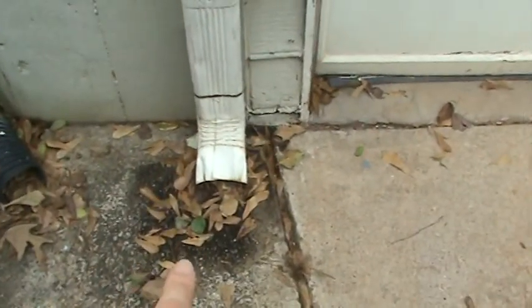So we would start with the chimney or the whole left side. The backside of the house is in pretty decent shape, surprisingly. See this downspout right here? Completely clogged — so all the water's run down this side of the house and just rotted the siding out. The gutters have stuff growing out the back, so these gutters haven't been cleaned in at least a couple of years. The back of the house is mostly the lower six boards; the rest of it, see how nice and tight the bottom edges are? If we came in here and caulked it and hand-painted it, that siding would be all right. If you spray paint it, it's not gonna do much — it'll make it look pretty but it doesn't really seal the siding.